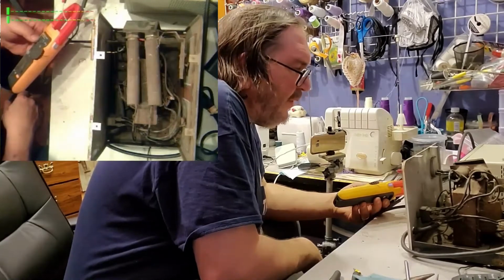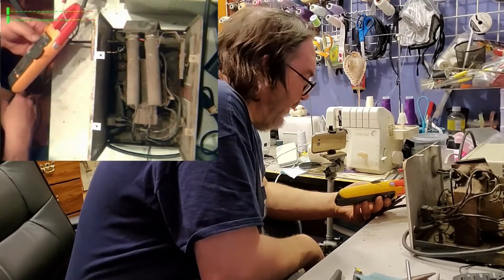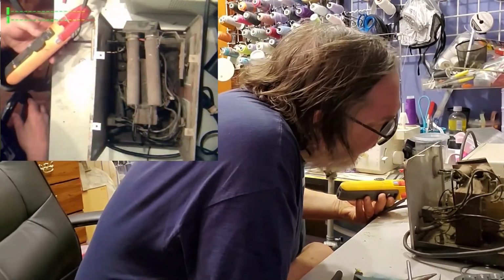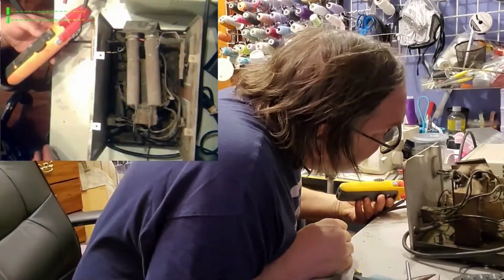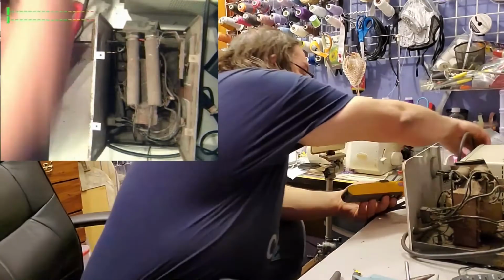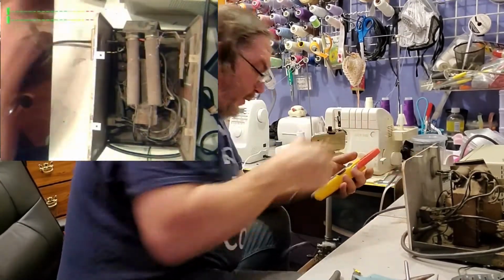This is a good battery charger. Now I know the diodes won't go because those are like 200 amp diodes made for a rectifier from a power supply from an old piece of medical equipment. So I know those ain't going anywhere, and that transformer looks like it would handle quite a bit of current for quite a bit of time. But this is doing what I want it to do. So let's pull the plug. No current. I don't hear the buzz. Life is good.